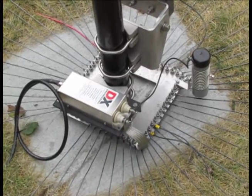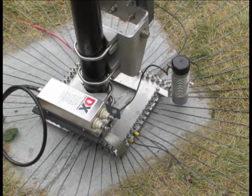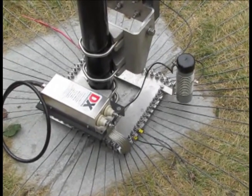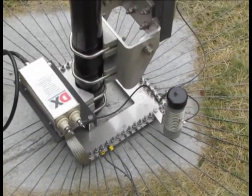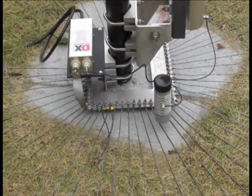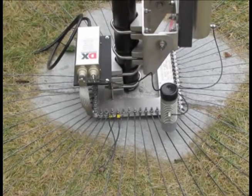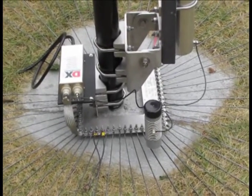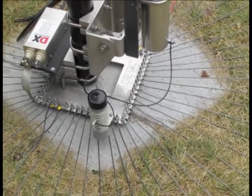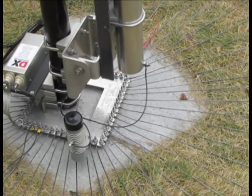Here's the base of the antenna. You can see I mounted the current choke. Even though the current choke isn't designed for this antenna, it was simple to mount it on the mast. I had to drill out a hole on the base plate to accommodate a three-inch clamp to go around the mast. The coax comes into the current choke, the choke is then grounded to the radial plate, and then it goes over to the matching network, which adds a little inductance to lower the SWR, and then it attaches to the base of the vertical.